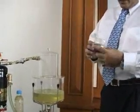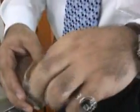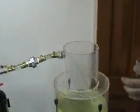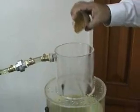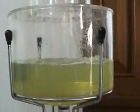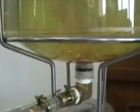So we are going to start with the next experiment, using solid particles. It's actually sand that we got from a construction site. It has a lot of fine particles plus the other ones. We will try, hopefully the pump will be able to pull up this diesel contaminated with sand, and get it through and see it's going through.